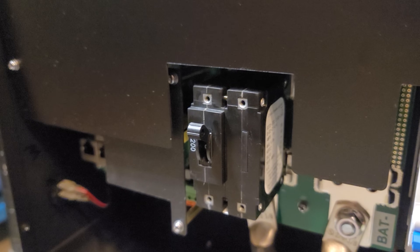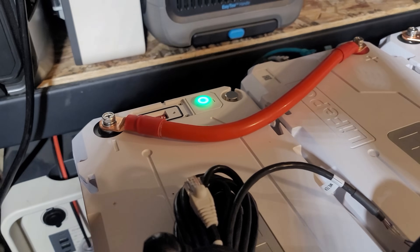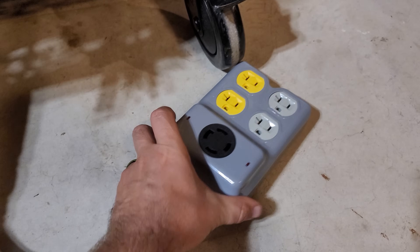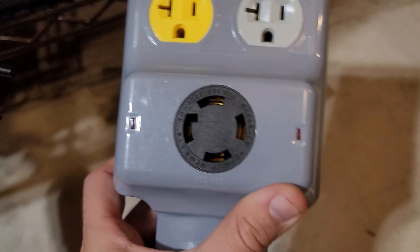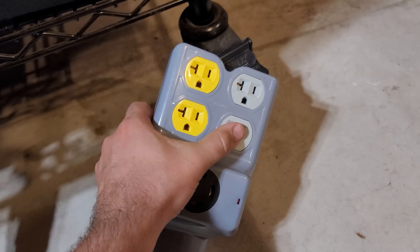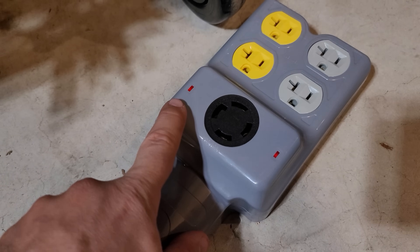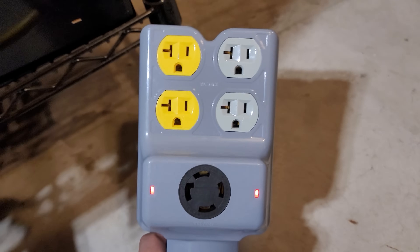Make sure the breaker is turned on and the switch is turned on, then turn on the batteries — all four batteries will turn on together. I was finally able to get the inverter working. The easiest way to get power from it is this $30 adapter I bought on Amazon with an L1430R that gives me split-phase power with two outlets on each phase — both 120-volt and 240-volt power up to 6,000 watts. I turn on the breaker and the side switch to get power to the power strip.